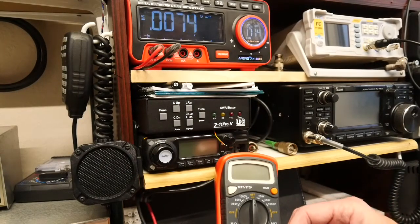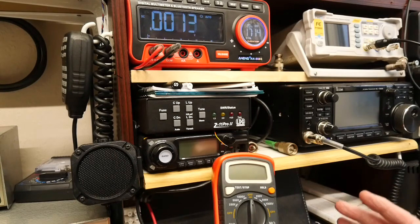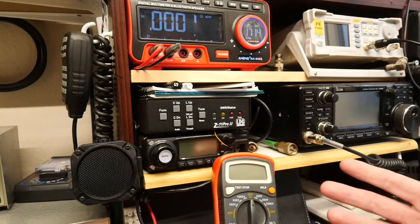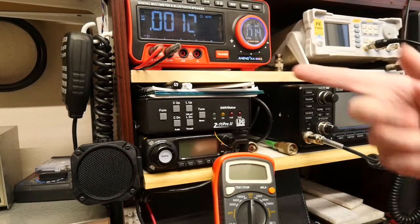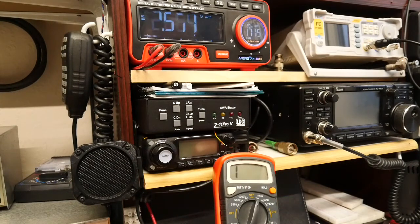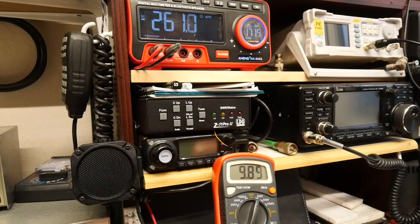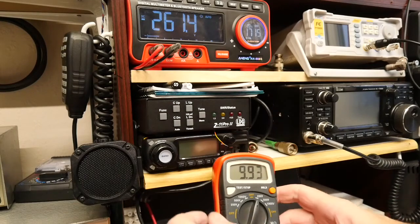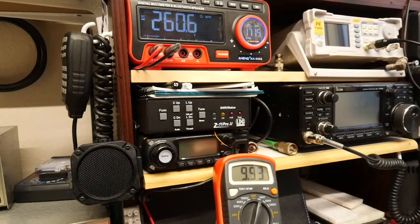Here we are with the BM500A. It has 250, 500, and 1000 volt ranges. The first thing I'm going to check is whether it actually puts out voltages somewhere near that, so I've got the outputs connected to a multimeter set to DC volts. Switching on to the 250 volt range and pressing the test button — yep, there you go, about 261 volts without any load. Presumably with a load it would be nearer 250. It's actually showing the roughly 10 mega ohm input resistance of my meter.